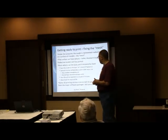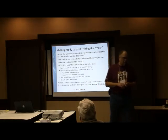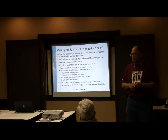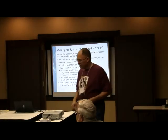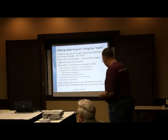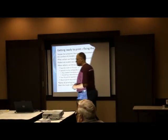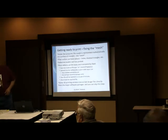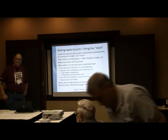The story that I had was, I had a hollow model and sent it to Shapeways. It came back as being, I think, $720 to print. I said, how is this possible? And support said, well, your model's too big. And I could see it was hollow. So I made all the walls of the model to the exact specifications of the smallest, thinnest wall I could make. I sent it to Shapeways, and this took a week, because I didn't know what I was doing. It came out $7 more expensive.